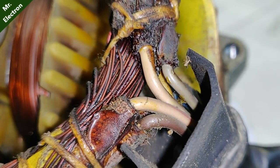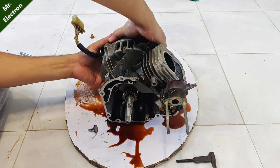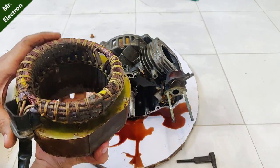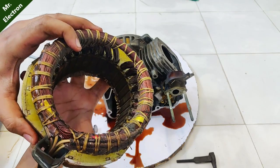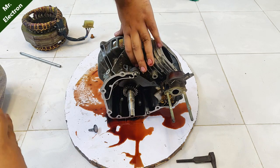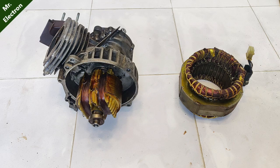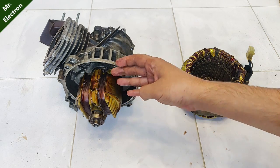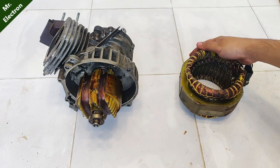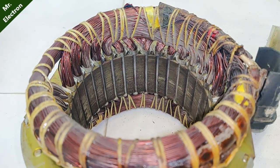As for the armature winding, the wires are thick with a large number of turns to carry huge current, and too many wires are coming out from it. Let's take off the armature winding and the complete armature core — and this is it. There is no harm to the armature as far as I can see. That's the rotor pole — this is the rotor, the field or excitation winding of the 600VA generator.